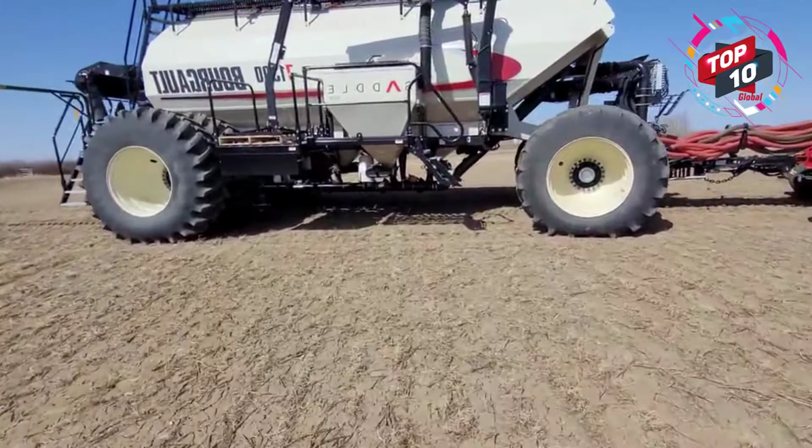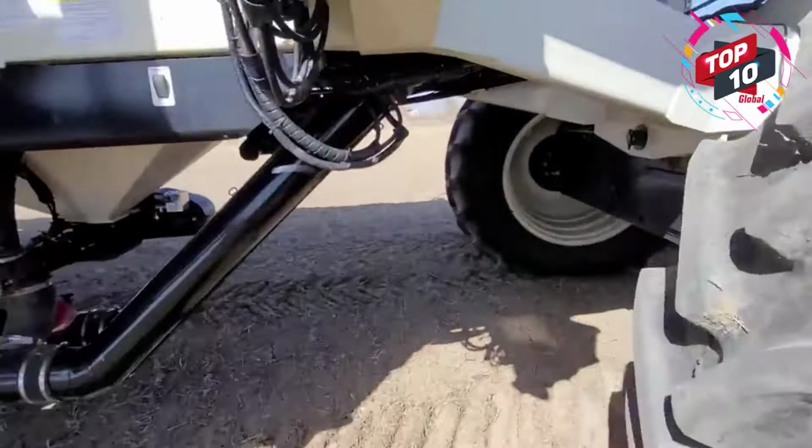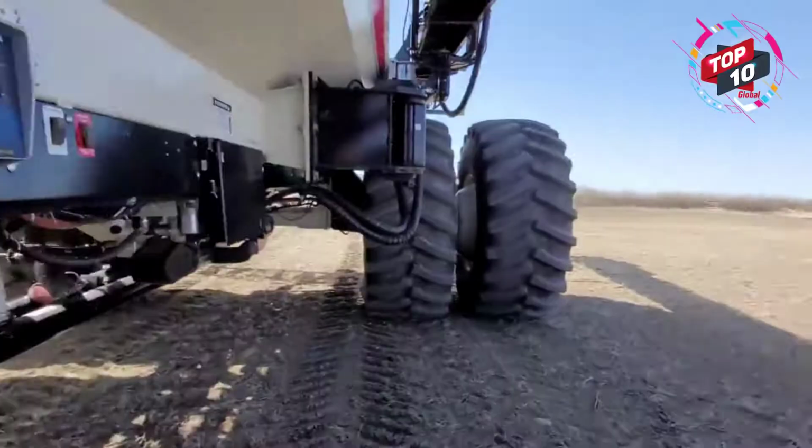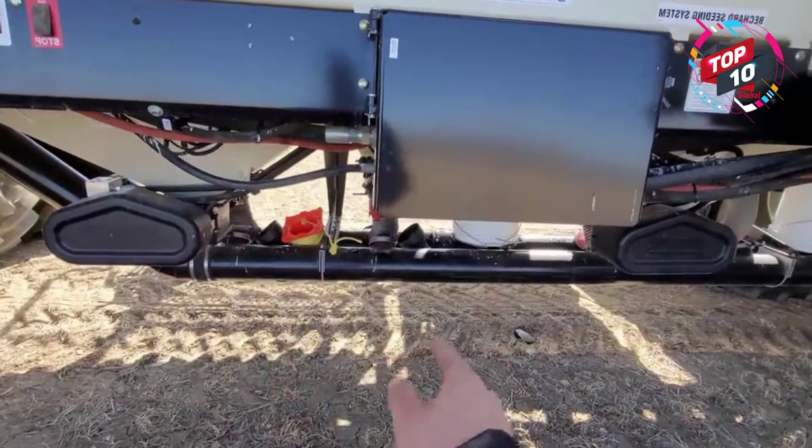I call it a crank test because we used to have Flexicoil 2320 tanks and used to have a crank on it. And we always used to have to manually punch out some seed. So I think that's why we still carry over and call it the crank test. So our fans are all going. Fertilizer's gonna come out one pipe. The seed and phosphate is gonna come out the other. When I say fertilizer, I mean mid-row. There we go, got it. Our three tanks metering are active.